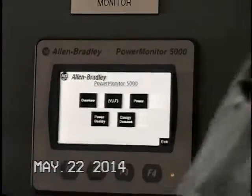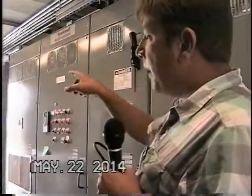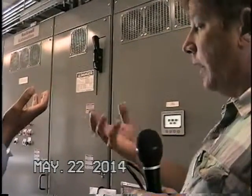Why did they put a minimum speed for the pot, for hand control? They start at 35%? It's because of the pumps. They at least require 35% for lift and for seal water. So if you're below 35, it doesn't get enough seal water, it's going to damage the pump.